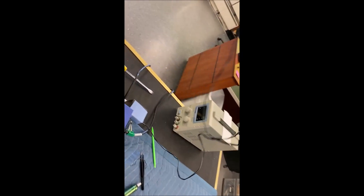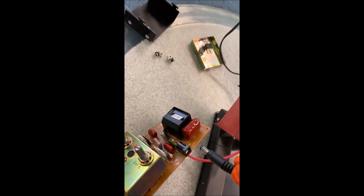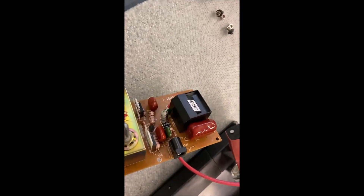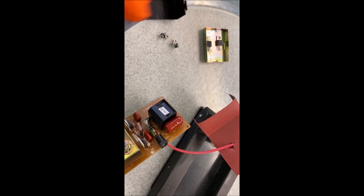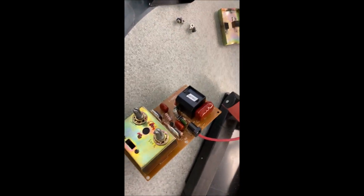I'm going to show you how this is done just in case you're wondering. We started right from the beginning — we took this cable and tested it at that junction box right there. We were getting voltage, so that was good. It plugged into that hole right there and that connection was good. Then we traced it back and checked out these two transistors — the TIP 41C. We changed those out and got nothing — it still just wasn't working.